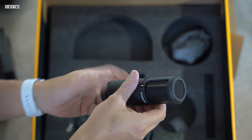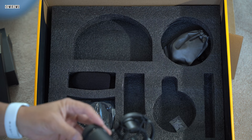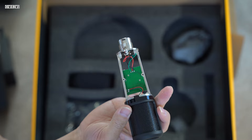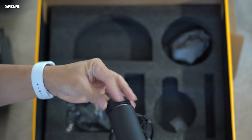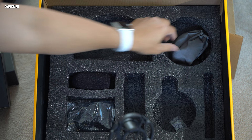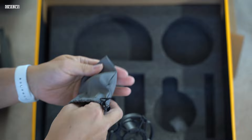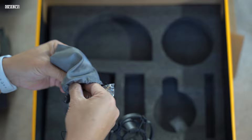Looking at the construction, it's somewhat user-serviceable. You don't have to take the microphone apart to put it into the cage, which helps isolate the sound. Inside the microphone it's nice, simple, and clean — solder points are all there. There's really not a lot that can go wrong with a microphone like this. Keep in mind condenser microphones are not stage microphones — they pick up a lot of noise around them, which is why the mixer has a denoise function with active noise cancellation. The sound is directional — a cardioid pattern picks up one direction and rejects the others.